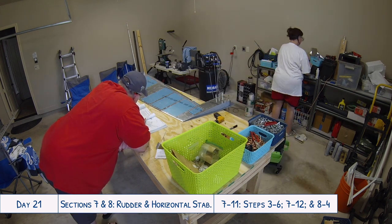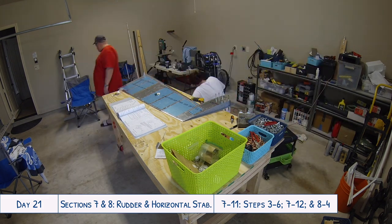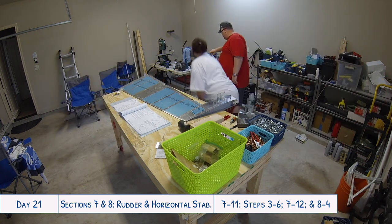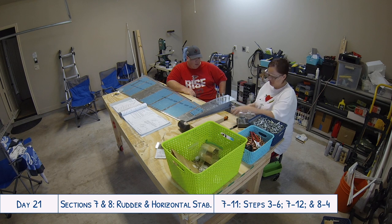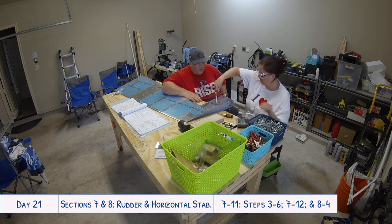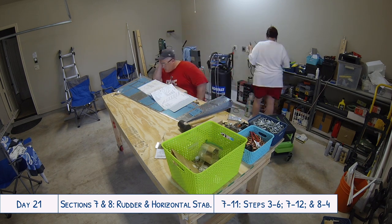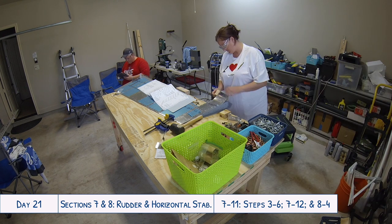You start by using your fingers and you can get quite a decent bend in the skin. Then you have to finish it to make a nice 90-degree bend so it's flush against the back of the counterbalance weight. The book talks about putting pieces of wood on the backside of the bend to back it up as you finalize the crease into an actual bend. You can't use a full two-by-four because the four inches is too wide to fit in that space where you haven't installed the three rivets at the top. So we just took a two-by-four, ran it through the bandsaw, and split it — that worked out fine.